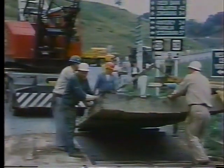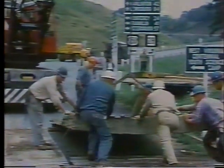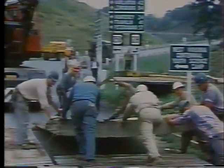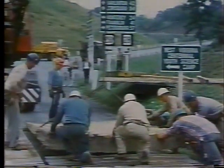All 7 bridges between the railroad siding and the construction site were sure to take the weight. Mats were constructed and placed to distribute the load on bridges and to smooth out rough spots in the road. Mats were set ahead of the move, picked up and reset for each weak, soft, high, or rough spot en route.